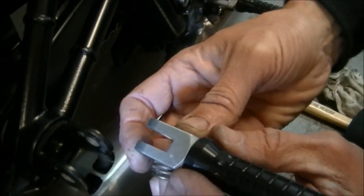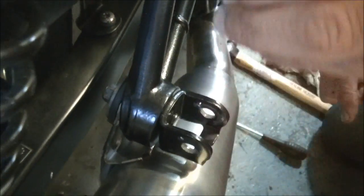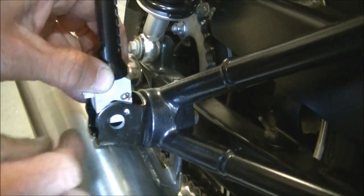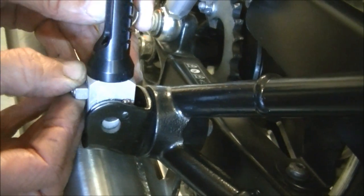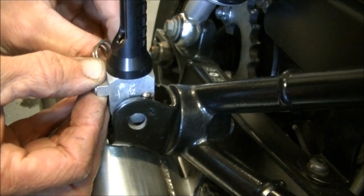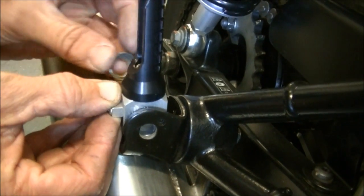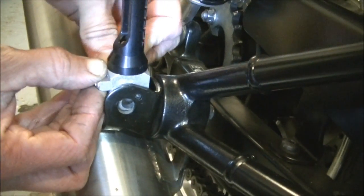Spring on that side. That has to be in the up position for the ball bearing to clip into this hole. So you insert it from the top down — you can see around this side, there's the hole it goes in. Pop it in there first, and then on this side put the spring into place second. Squeeze the spring in and that will push the assembly across into its hole.